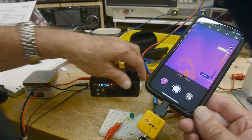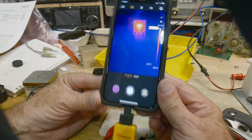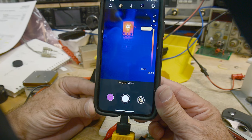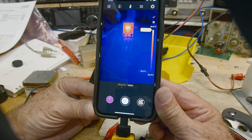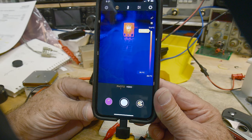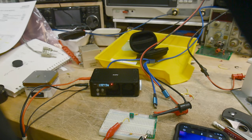Let's take it up further to 320 milliamps — 1.27 watts, 66 degrees C, climbing to 68. It's got pretty low on-resistance, like 0.09 ohms. We're at 71 degrees C. Still doing pretty good here.